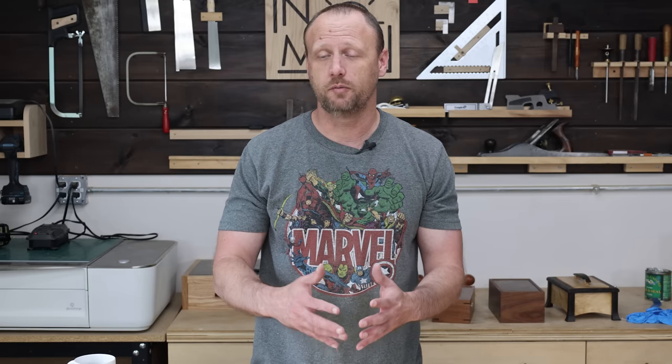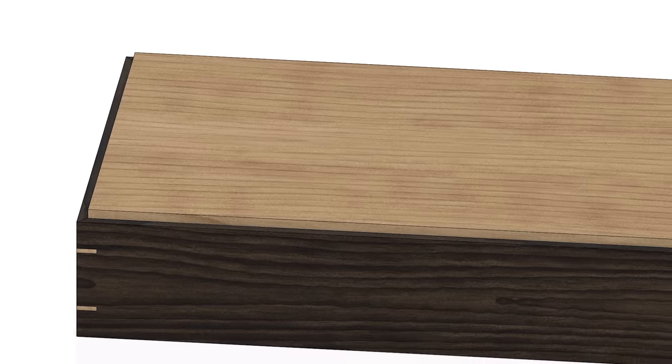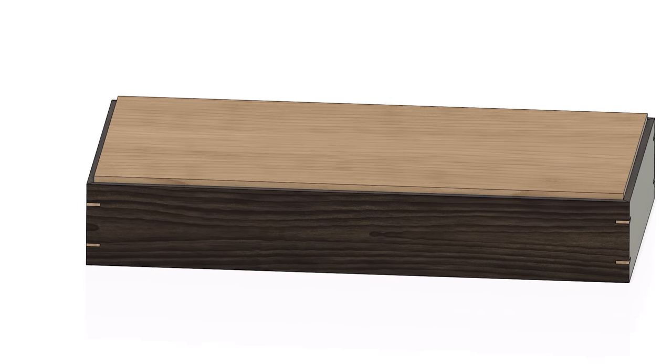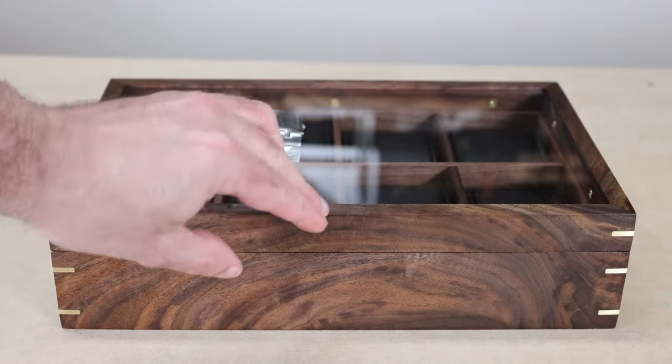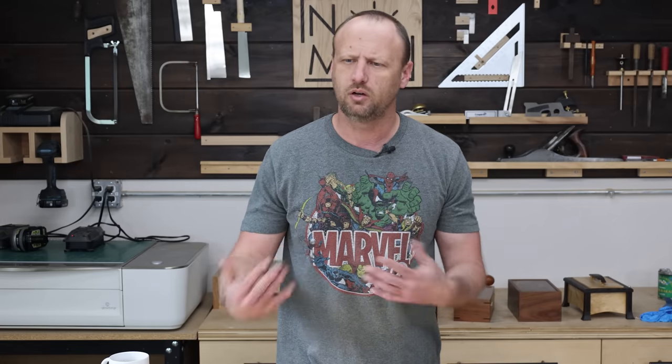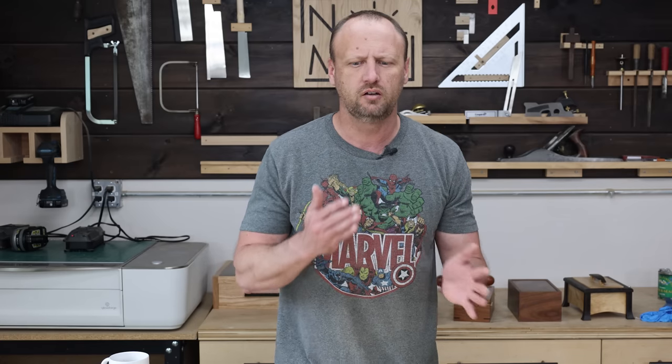I consider scaling really the most important thing when it comes to figuring out the thickness of your material. You don't really want to have a giant box with super thin sides — it doesn't look right and it's probably going to feel flimsy, too. At the same time, make a smaller box that's 8 inches long or something like that and use three-quarters material, and it looks too heavy. It just feels like it's a block of wood instead of being an elegant box. Looking back at my old projects, the thickness typically falls between three-eighths of an inch to five-eighths of an inch depending on the size, so the average is about a half-inch thick.